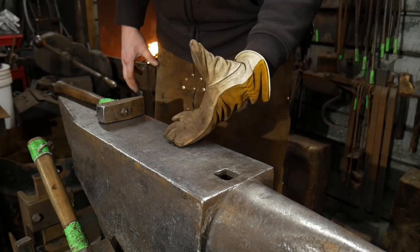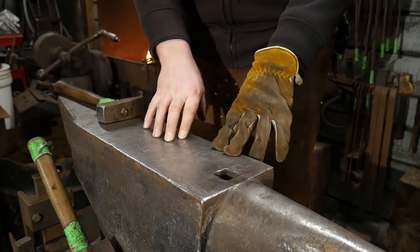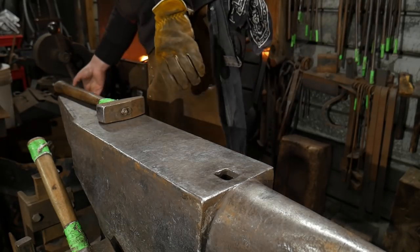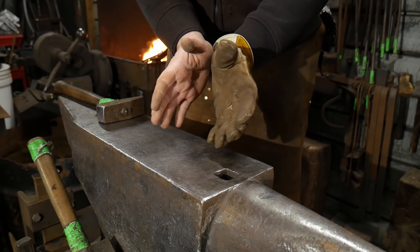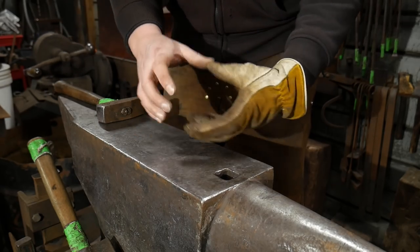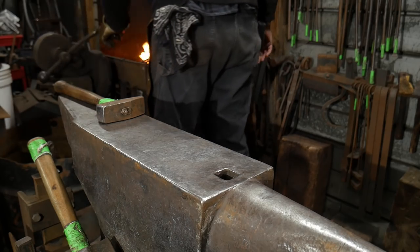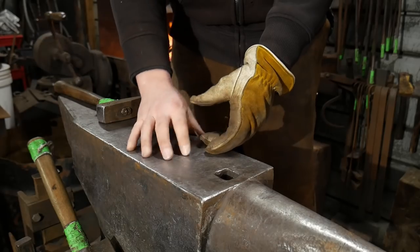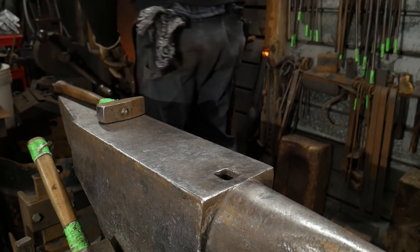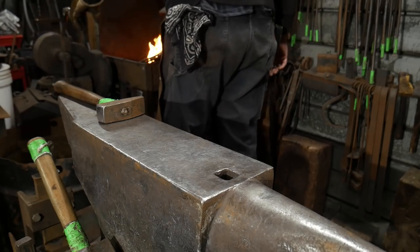The way we set that slug — we hammered it down so it would upset into the hole. That is what we need to do in the welding stage. We do not want to hit the sides of the hole. We just want to weld in the flat plane. The reason is that if you try to weld on the sides, that material is going to spread and be in a constant shear plane and you'll never get it to weld up — the hole will just get wider and wider and the centerpiece will act like a mandrel. So get it really good and welded first so it's all connected, with no difference in temperatures. Later, if you've got to come back and dress up the roundness, you can do that at a much lower heat.